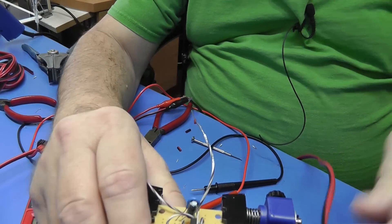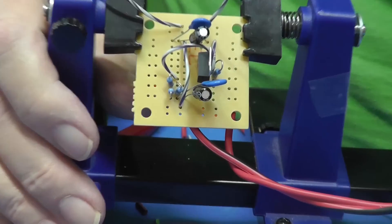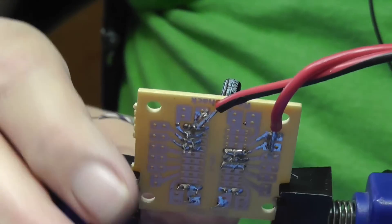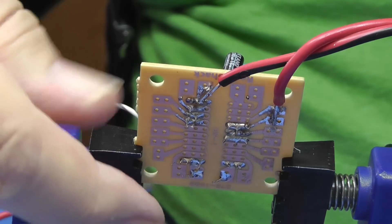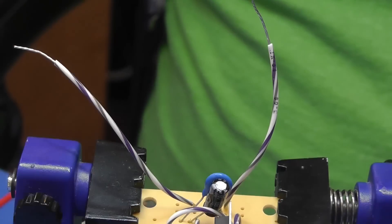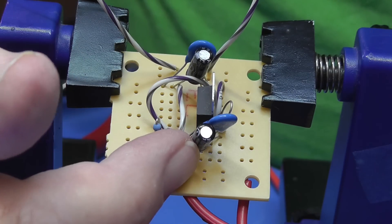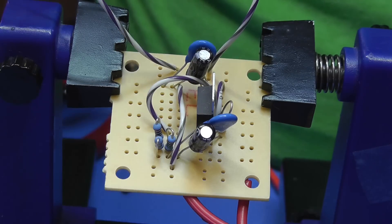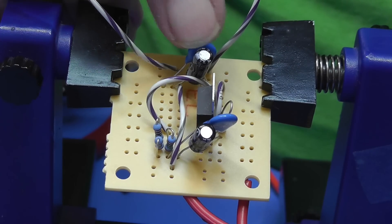This is the finished device right here. On this side is where the negative comes in and the positive comes in. That wire was too thick to go through the holes, so I just put a bunch of solder down and soldered those into place. What I have on the board: this is the input right here, and I've got a 100 microfarad, 16 volt capacitor on the input. And 100 microfarad on the output to smooth any RF.